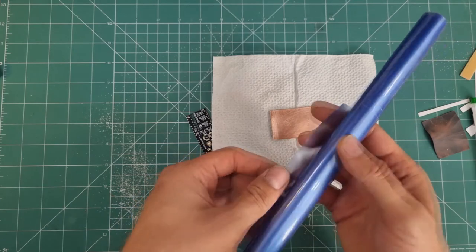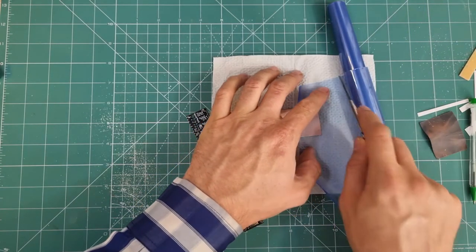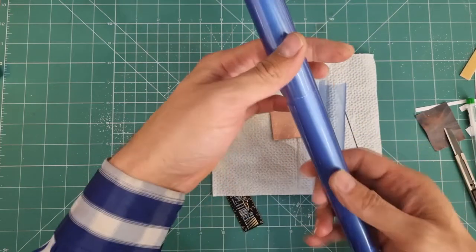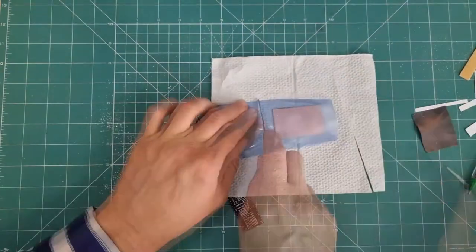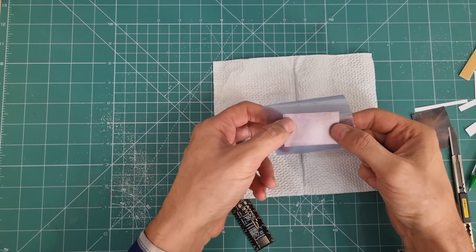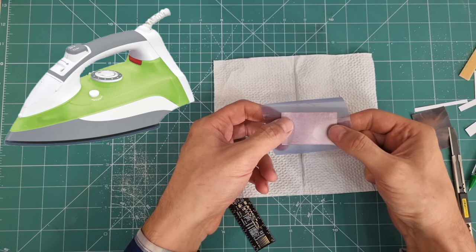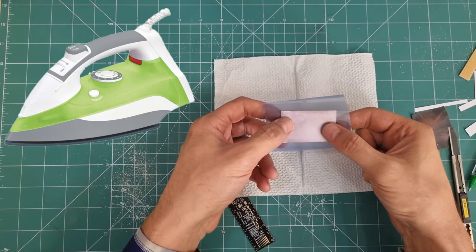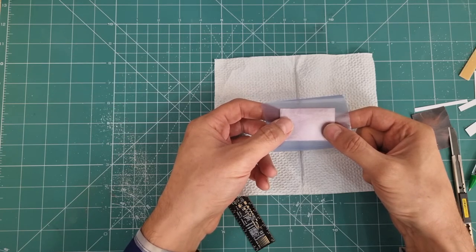Next step is to cut a piece of photoresist dry film. Critical point is to store rest of photoresist film in absolute dark place. If not, it will be corrupted. After that, we should paste the film to board surface. Most easy way to do that is by using electrical iron. You can do that by using electrical iron, but the best way is to stick it using laminator machine.